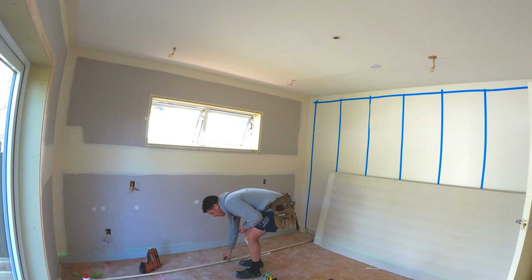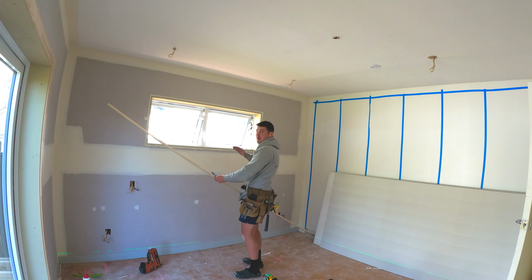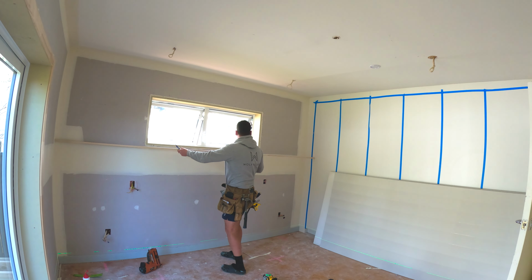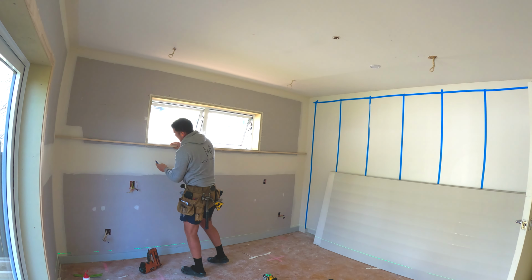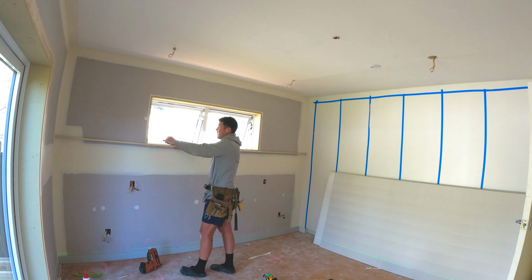Now, I've got this top ripping here. I haven't made it too intrusive as like a top cap to sit on the top, and I want to line this up to our quirk on our window, you see. So if I line that up right there, I'm going to be pretty happy with my quirk. So pretty much just going to measure to my quirk from the bottom up, and then minus this 18 mil. And that's going to be pretty much the length of my board.